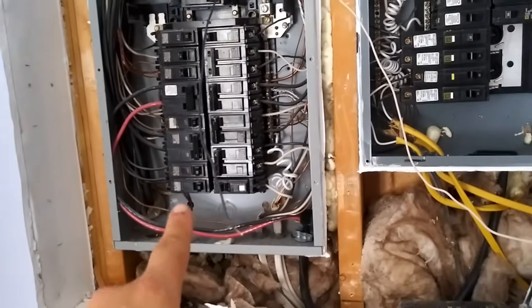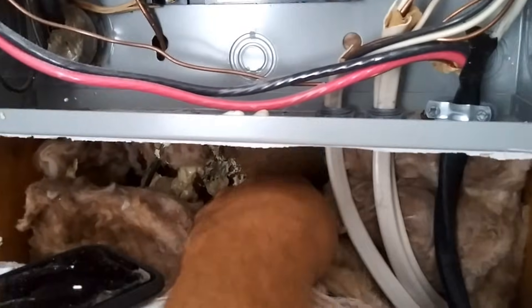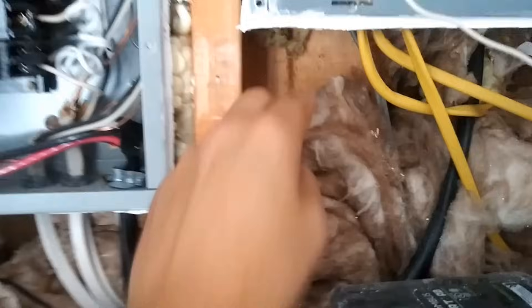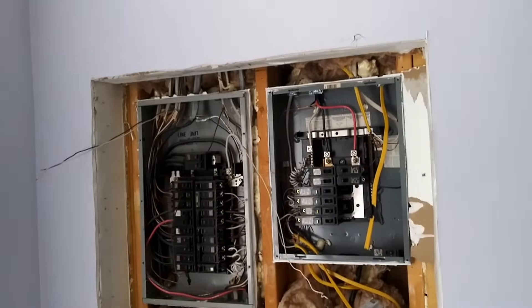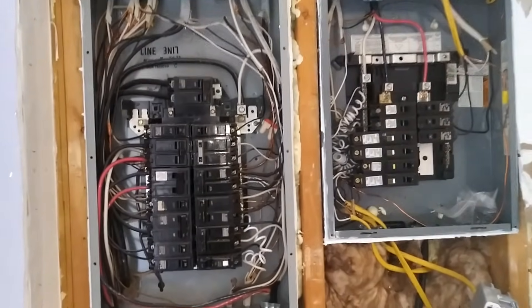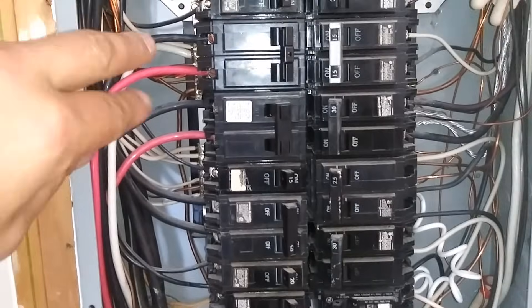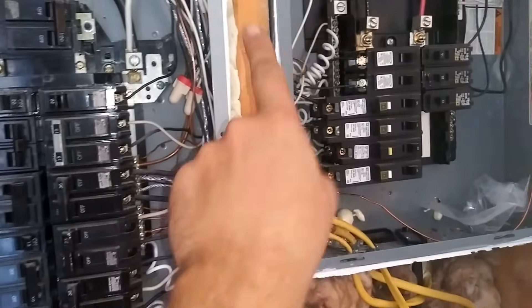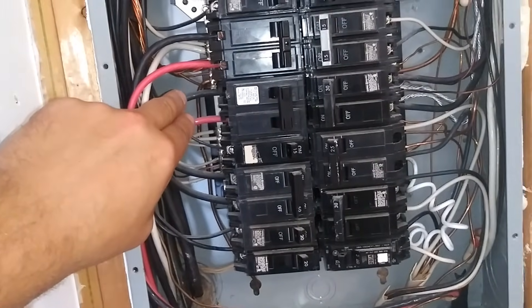This is the box inside my house. We're going to run wire from the main panel, so we're going to have to rewire some wires, then drill a hole through the outside — you can see the fiberboard sheeting. About three to four hours later, that's how long it took me to rewire this. You see a set of wires going to the sub-panel, with two 6-gauge wires running to a 50-amp breaker.